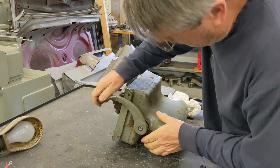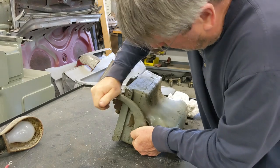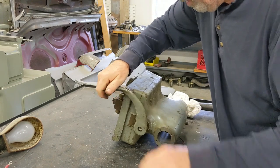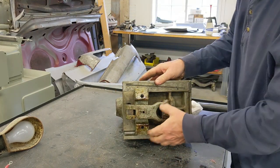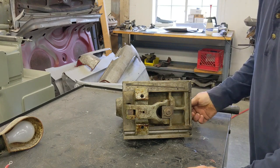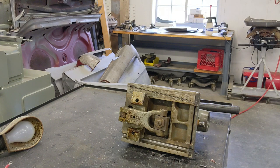Okay, there's that roll pin. It's loose on there but just doesn't want to come off. We've got quite a contraption on the end of this thing to lock the tailstock down. It looks like there's a shaft that goes in here attached to that lever, with a cam in there. When you rotate that, you pull up on the clamp against the underside of the ways and lock it down.